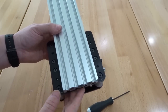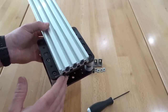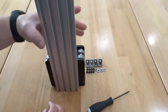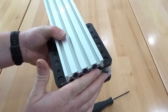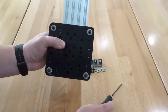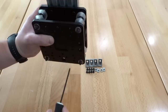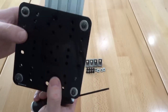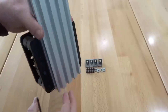Flipping the assembly around, we have access holes so we can tighten down our gantry plate. Double-check to make sure you are flush against the end of the plate and there are no gaps between the extrusion and the gantry plate — that's a nice mated configuration. Now we'll add our cast corner connectors to the sides of the extrusion. First insert two T nuts to each side of the 20x80 extrusion, making sure the flange side faces the inside of the track.